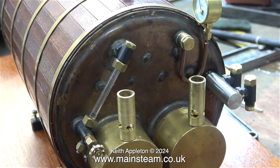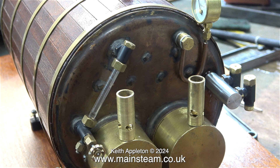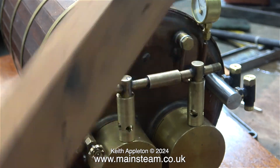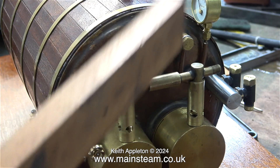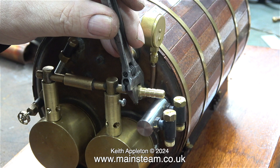The water level in the water gauge is intentionally low because I need it like this so I can test the injector. Using a piece of mahogany, I'm tapping the jet mounts into the Venturis. The gas definitely burns cleaner when these jets are in a lower position — the higher the jets, the more smelly the products of combustion are from the chimney.